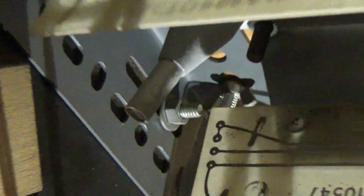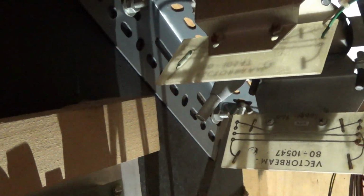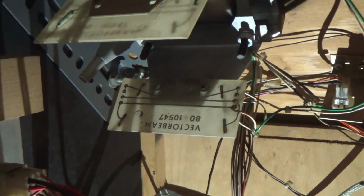And when it gets next to this sensor, or that sensor, or that sensor, it will know what gear it's in. Now it looks like there is no sensor here. And so I guess there's only 3 out of the 4 sensors that are actually populated. Although that doesn't feel right. It looks like I have a missing sensor entirely. I do. Why would they put wires there if there wasn't supposed to be a sensor there? So it looks like I'm missing one of these.